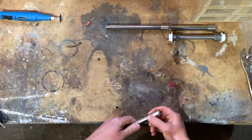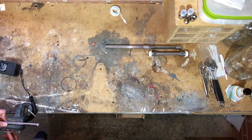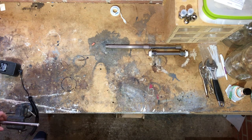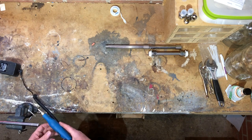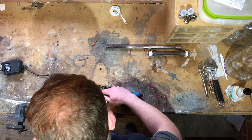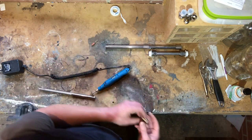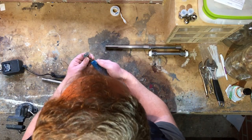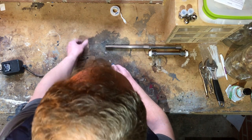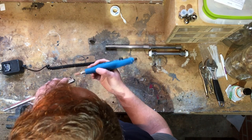The first thing I did was extend it out and cut it off at the ridgeline at the bottom using the Dremel. I put it ever so loosely in the vice — do not crush it because you're not going to do yourself any favours if you make it oval. Cut the bottom piece off — it'll be covered in burrs. I call it a Dremel but it's just a rotary tool, probably the cheapest one on the market. It works fine.